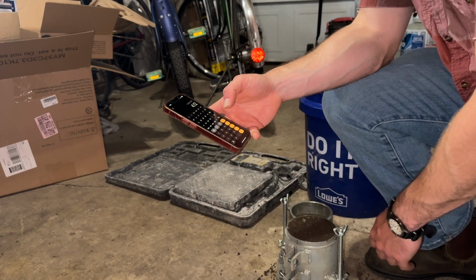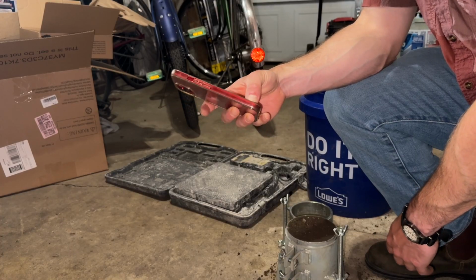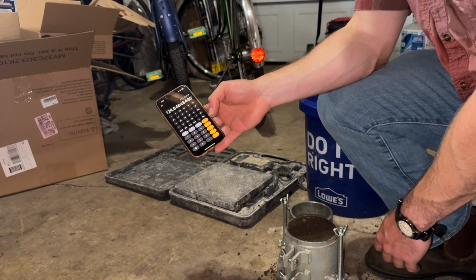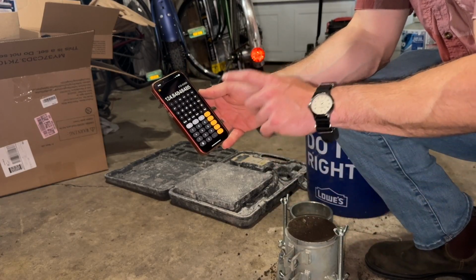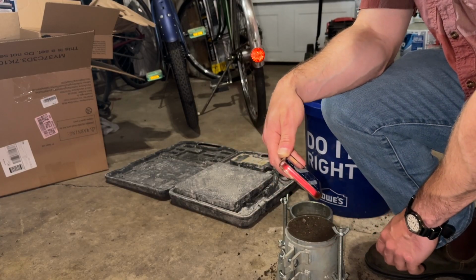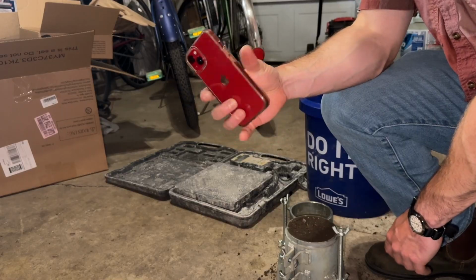The mold is 1/30th of a cubic foot, which is 0.033 cubic foot. So we're going to divide by 0.033 to get the wet density of the soil. We have 124.85 pounds per cubic foot. And we're going to enter this wet density into our chart along with the moisture content that we got. We're going to plot it into our curve to get a maximum dry density that we can test against in the field. And I'll walk you guys through how to do that on the computer.